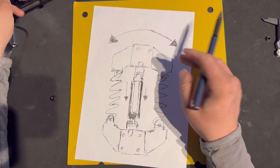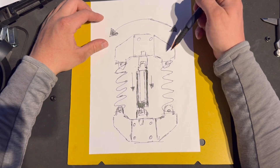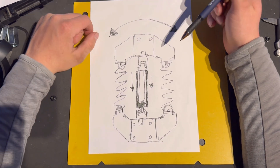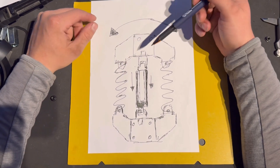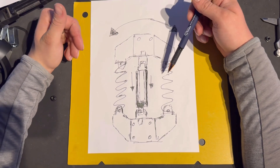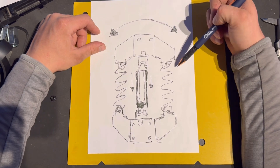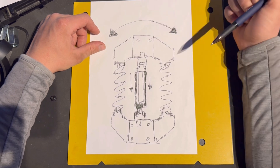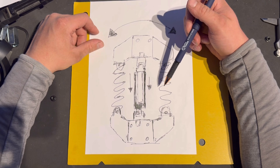So what are the problems with this design? First, how I made it out of aluminium — quite problematic and took a long time to make, and it still looks rough. The other issue was attaching the springs. You can't just use shock absorber fittings like on a mountain bike because you need the spring to both compress and extend. What I had was bolts and washers going through pegs to hold the springs in place while allowing both compression and extension, but it was rough, not very secure, and made quite a lot of noise.